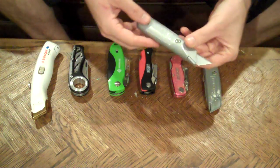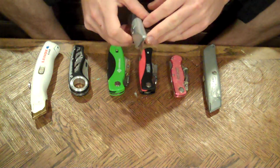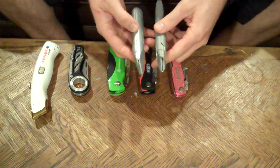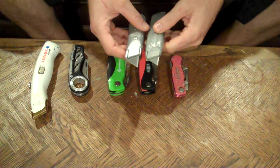Starting from the beginning, we have the Stanley 199. It's a fixed blade utility knife. It's one you're going to see used by a lot of drywallers. I don't always reach for it as my first choice, but it does have some advantages. It's good for drywalling because it has this nice bevel — you can kind of see that as compared to the Stanley 99E. It also projects more of the blade, which can be an advantage in certain instances.